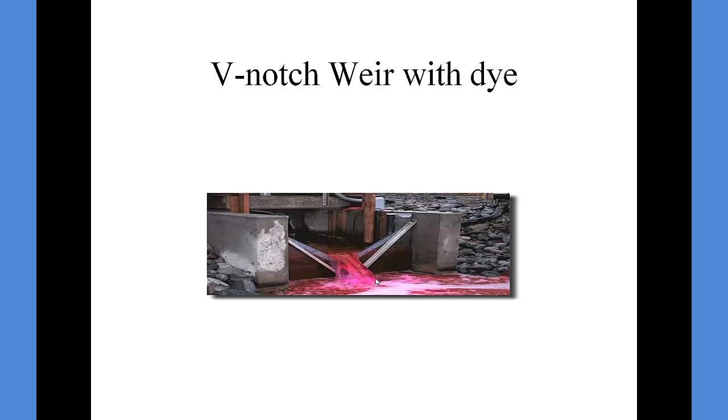Especially storm sewers that have been around for a while — it's unknown what exactly is being fed into them. A perfect example is a field camp we had a number of years ago where we had a late spring and the ice hadn't come off a lake up north, so we had to have camp in Lindsay. One of the activities was collecting samples from storm sewer outflow and seeing what parameters we would find. It poured rain the night before and the morning of, and alarmingly, a bunch of students came back reporting that there was raw sewage coming out of a couple of those storm sewers. It turned out that some older homes in town were not attached to the sanitary sewer — they were coming out of the storm.